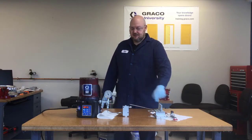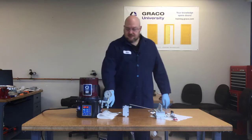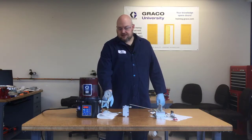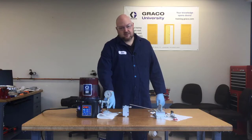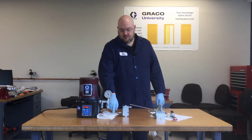This little pin just extended here, and now there's some grease coming out of this fitting. This fitting is the relief valve. The relief valve is typically chosen to have a pressure that's going to be lower than the pressure rating of your tubing, so that your tubing doesn't become the relief valve. This way, the relief valve dumps off extra pressure to prevent any lines from breaking.